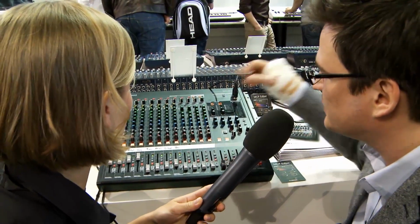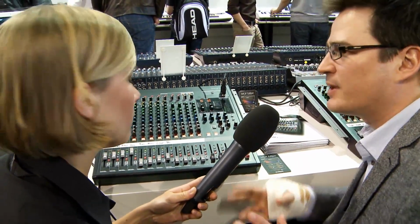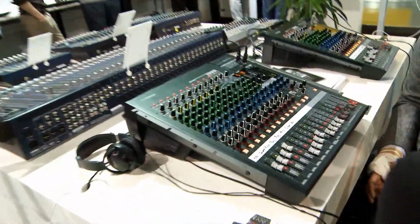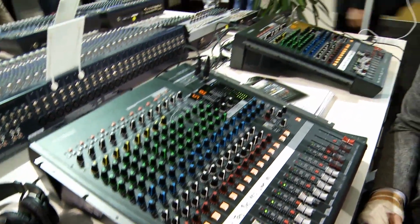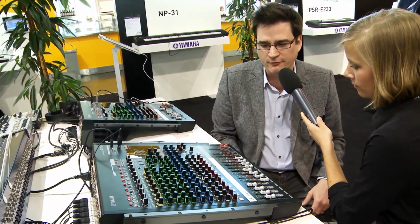And moving into the EQ section, we designed it to have a very classic, what everyone calls the British sound. And we've done this by modeling famous analog EQ circuits, and not digitally, but in analog, reproducing that type of circuitry in analog with the hysteresis, as it's called, or overshoot characteristic of the EQ, which brings a warm and musical sound that people really like. So we wanted to bring that into a compact mixer format.